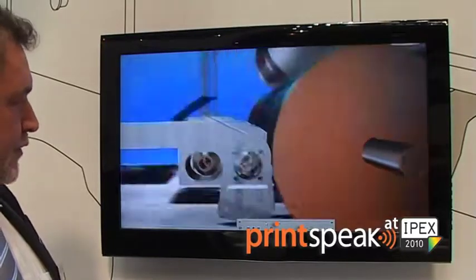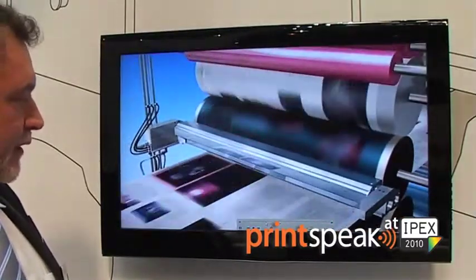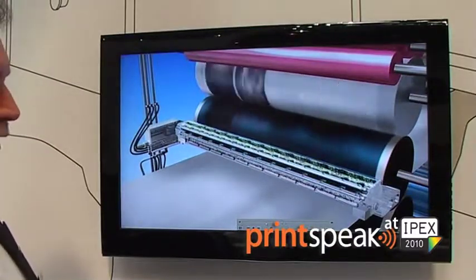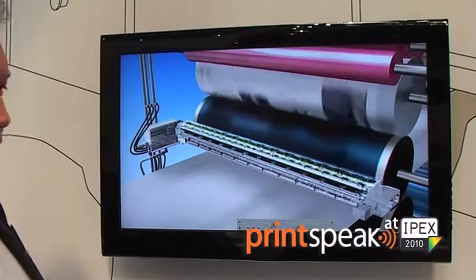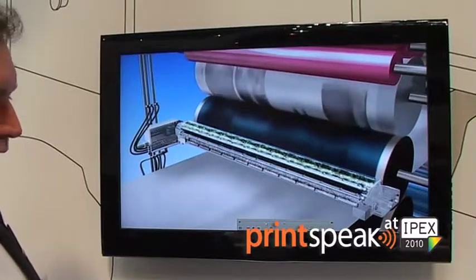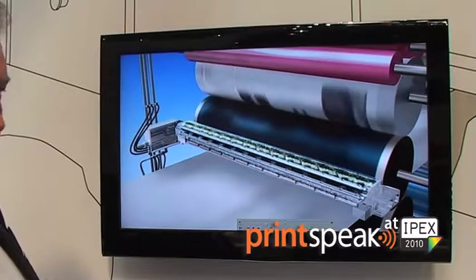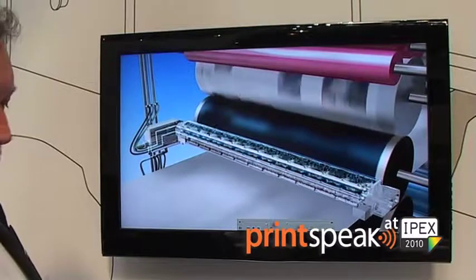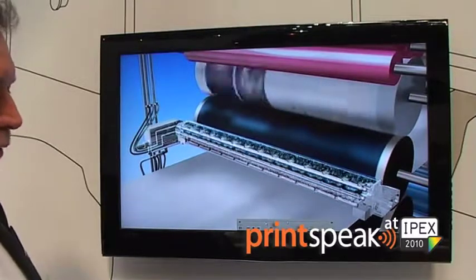The complete system moves to the cylinder and back by signal itself. What you can see is the spray onto the brush without the blade in contact, and after we have the contact with the blanket, the blade goes in contact with the brush and takes the dirt off. Underneath you see the spiral moving and pushing the dirt out of the chamber.